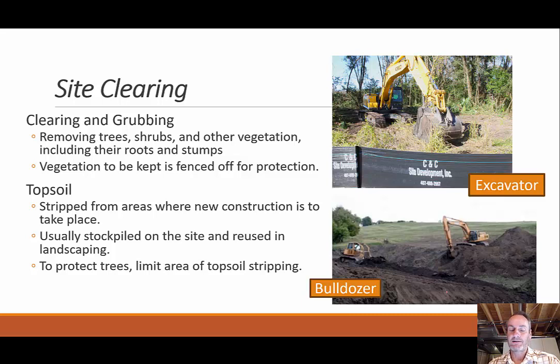So with that, we have site clearing — clearing out the whole site. Clearing and grubbing, you'll hear that word sometimes. We can't put our building right on top of some active vegetation because it will start to decompose. As it decomposes, you'd have voids, and if you have voids, things start to settle and it's a nightmare. So we need to get down to natural soil, meaning we have to clear off the topsoil and strip it down. We do stockpile a lot of this soil so we can use it later on in landscaping.